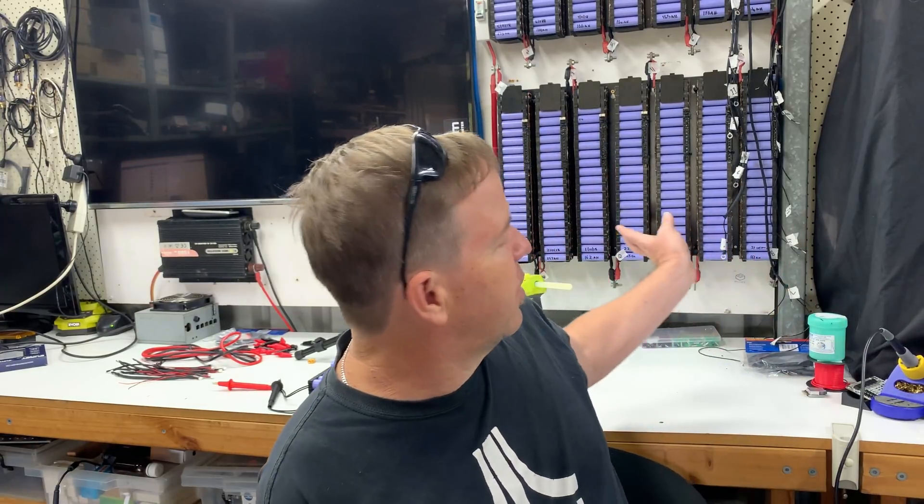The light was running for three days, so it was the inverter and the chargers and stuff like that, so the battery was pretty much flat. There were two cells here that were only about half a volt when I saw it, and then there was another couple of cells that were 3.2-ish volts. I dare say it would have been flat for a long time and reverse charged — the battery was so flat it just started charging in the opposite direction, which apparently kills the battery.